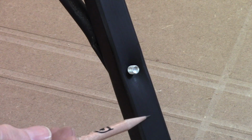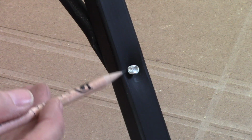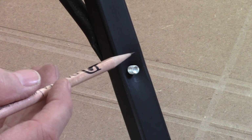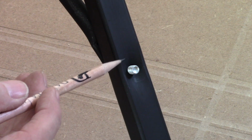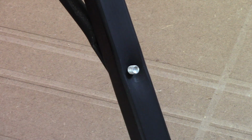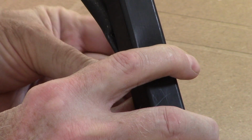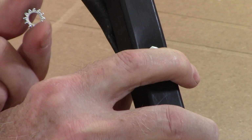The instructions call for the bolt connecting each brace to its post to be inserted from the front of the post, that is, the side facing the tractor seat. But because of this recessed area that's formed in the posts, there's no flat surface for the washers and nut to press against. Turning the bolt around solved this, and even though it prevented placing washers under the bolt head, it still seemed to work fine.